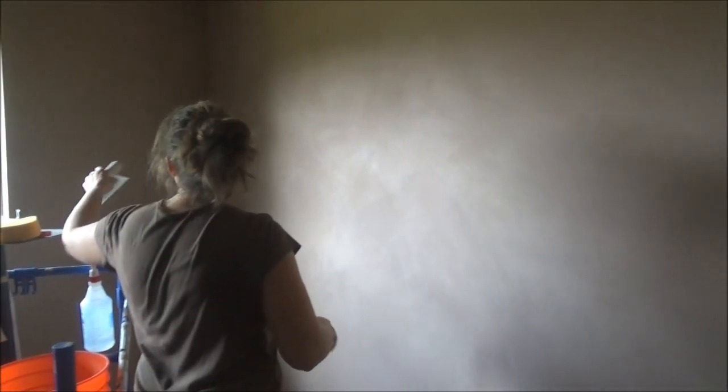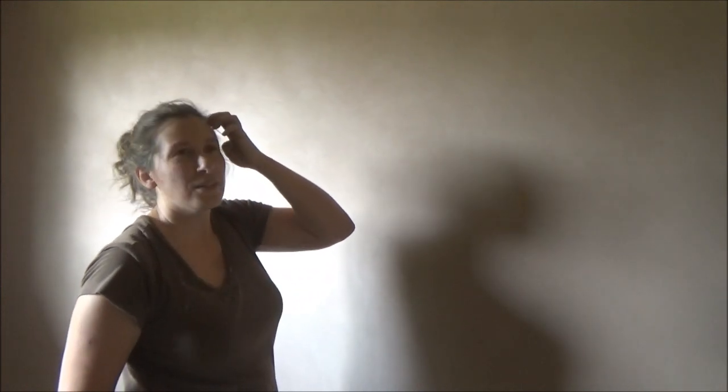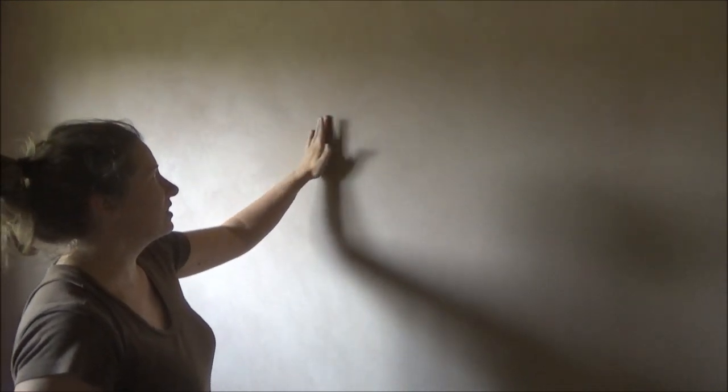So this hasn't been compressed yet, but it has its second coat of Loma. What is compressed? Compressed is where, after you have your two coats on, you come back and spray it down, rehydrate it just a little bit, get your trowel out, and go over it and smooth everything out. It's a chemistry thing that happens with the sand and the clay, but it allows it to settle in, so it makes it more durable and it doesn't get dusty. Then that gives you an opportunity to really smooth it out and make it shiny or whatever you want to do.